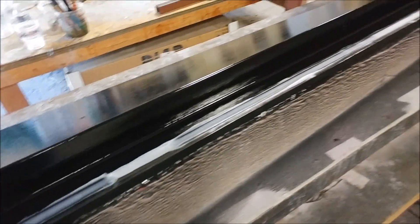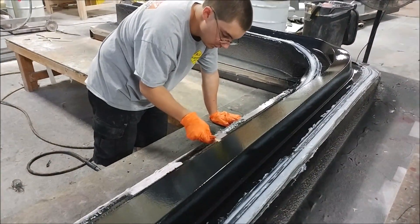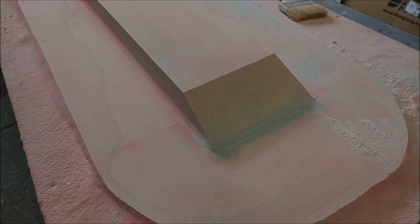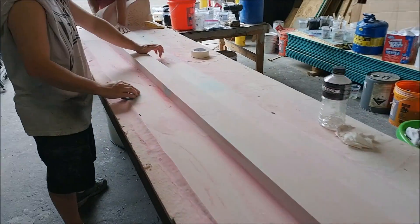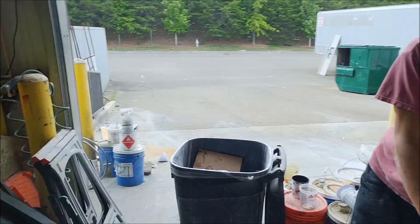You can see they're putting some cabosil around where the wax profile is in order to smooth things out, so it's easier for the carbon to lay down flat. On Thursday, the guys started sanding on both of the aileron spar plugs. Those are actually a little smaller and came out a little better than the wingspar one, so they'll need a little bit less work.